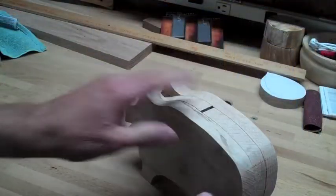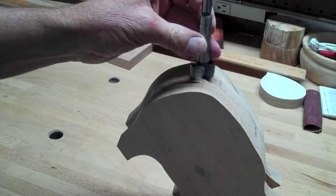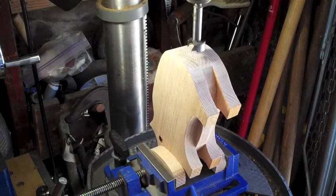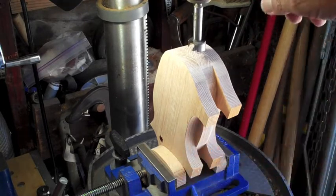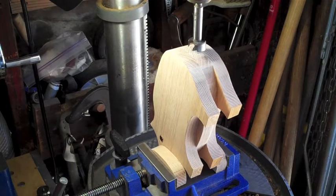You have to think of a way to get the coins out. I'm thinking about taking this one-inch Forstner bit and going in at an angle — kind of where his tail would be. I think I could put a cork in there, but I'm going to make a wooden plug because I have a lathe. Here's a quick look at the setup: I have a machining clamp down here with two pieces of oak below it to protect my piggy wood. I have a one-inch Forstner bit and I'm going in on a flat surface right between these pieces. I'm going in end grain, so I hope I don't get any chipping.